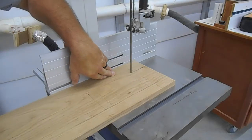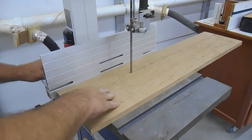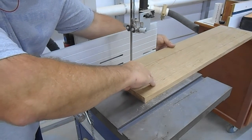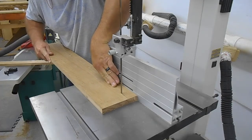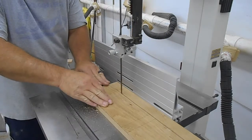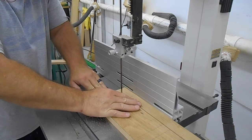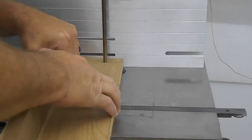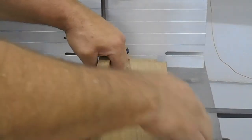The drawer facing is also going to serve as a rail for the face frame, and I also wanted a continuous grain flow, so I marked out my cuts on the selected piece of wood that I was going to use and went over to the bandsaw. This facing will have one actual drawer in the middle and 2 false drawers on each side. Being extremely careful to keep these pieces in order, I cut off both tops and then cut off each drawer divider in each drawer facing.